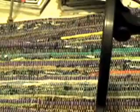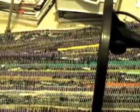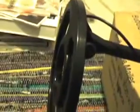Now we're trying the all-metal detecting mode, which is the middle toggle switch. Sensitivity is at about three o'clock, discrimination is at low. Notice the tone — that's silver. Quarter — close. Nickel — same. Copper penny — good. Gold — good. Aluminum foil — picks that up. So it picks up everything in all-metal mode.